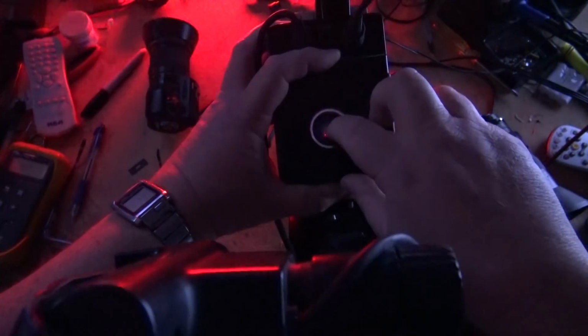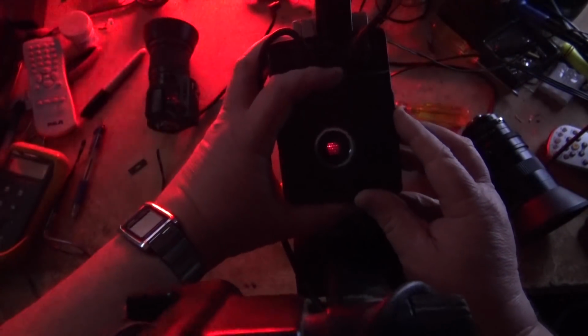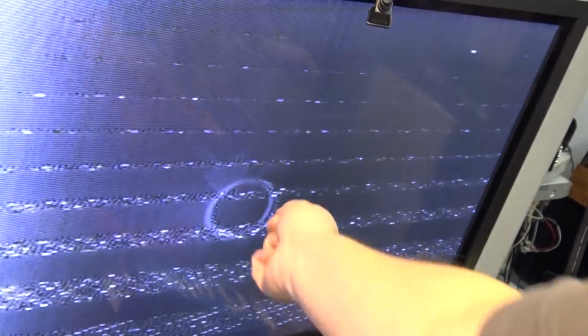Oh no, Sony, if I unscrew the lens here, they actually illuminate the front of the tube, as you can see. There's the bias light shining on front of the tube. As you can see, the tube on this camera is shot. That's capped up completely. There's no light at all.